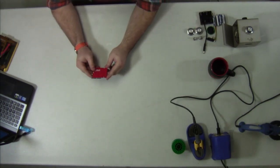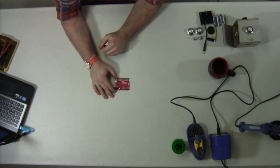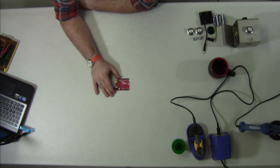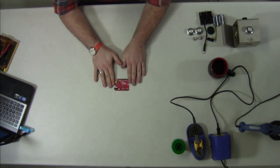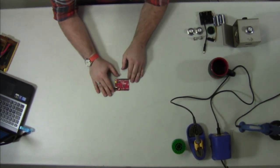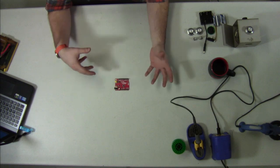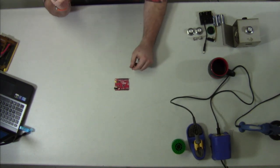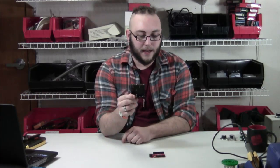On the wish list, you'll notice that the whole thing sort of revolves around the SparkFun Redboard. The Redboard is our Arduino — it's sort of an Arduino Uno clone. We use them in education because they don't change very often, so educators can get a hold of these and know they won't change for a while. We like them because they're a little less expensive, and it's the same form factor as all the other Arduino components, so it's shield-compatible. I like to use them because they have a barrel jack for power, so you can plug our 4AA battery holder directly into the Arduino. That's the heart of the project — our Arduino controller and our 4AA battery holder.